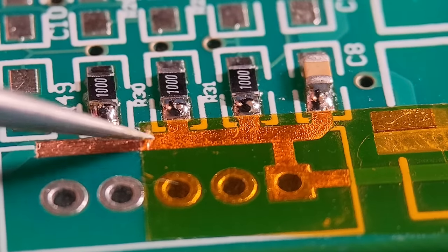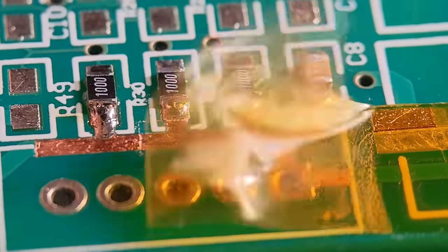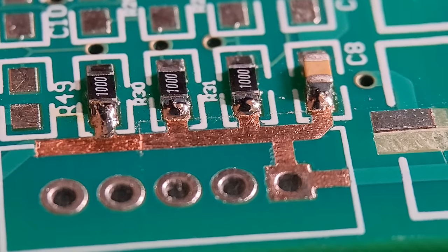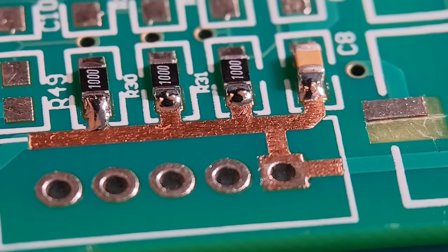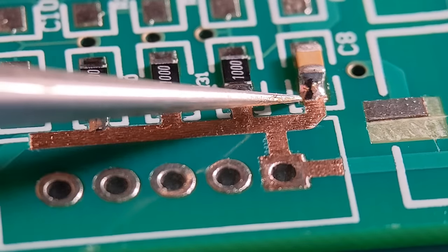I'll just get the tape peeled off now — just pull that off. If you get proper Kapton tape from the proper dealers, it's very sticky. As you can see, it's done a perfect job of stopping the solder flowing. Just going to give it a quick wipe over with my UltraSold cleaning fluid so you can see the results clearer. You've got the perfect result — it hasn't gone beyond where the Kapton was. But this end one has come right out onto the trace. Whereas the others stopped right at the point where I intended.